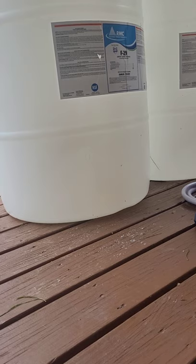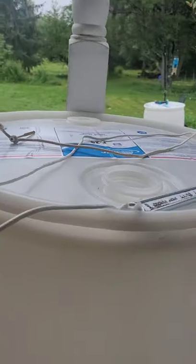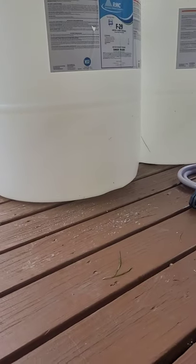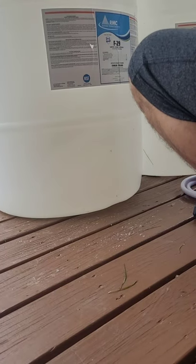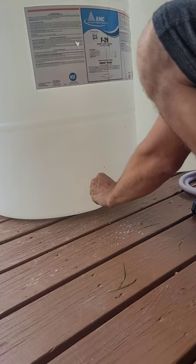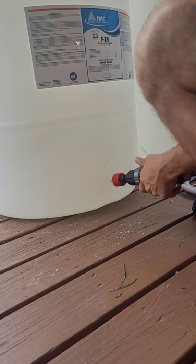We're ready to drill our second hole down here. These are how I'm going to have the barrels aligned — the reason I did that was strategic. This barrel is going to be facing the other way when it's on the other side of the porch. On the side here we have the fill lines so I'll know how many gallons are in there. We're going to flip this back around to drill it, and it will be facing the other way when installed. We'll measure three inches up, find the center point, and drill with the one and a half inch bit.